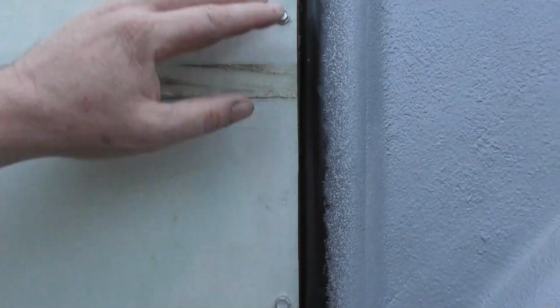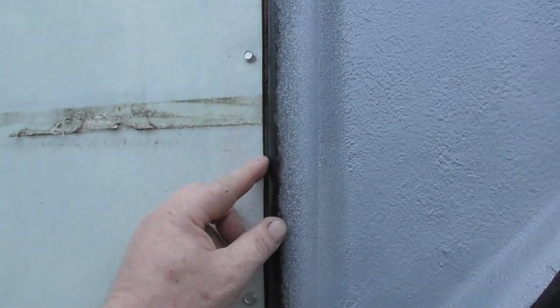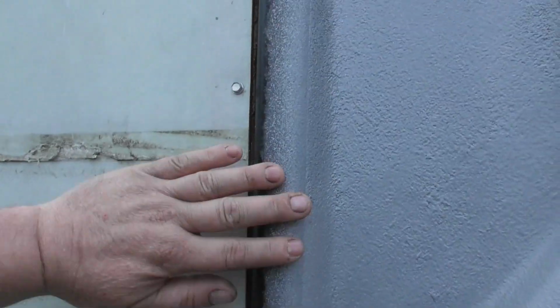What I actually intend to do with that is I'm going to remove all these screws, they're not needed no more, and I'm going to grind all the way down that edge, and when that filler foam comes blowing out, I'm going to cut it, get it all nice and trim, and then we'll put some fiberglass tape and some surface tissue over this, so we'll sand all this paint back.